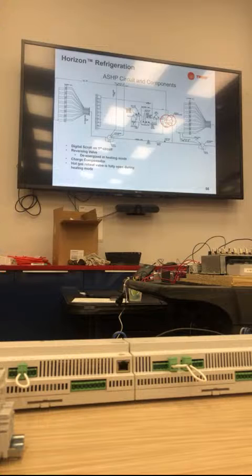Moving forward, we're using a biflow liquid line receiver. I'm sure most of you know what liquid line receivers are, with the tubes where one's higher than the other. So typical liquid line receivers, liquid comes in here, and then you pull from the bottom because that's where all your liquid is. What we switched to is a biflow.